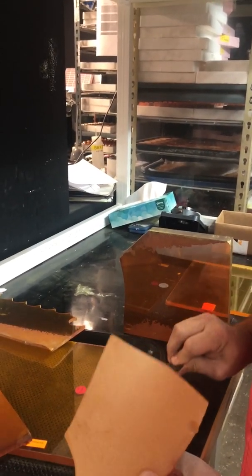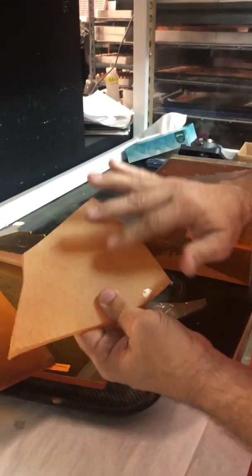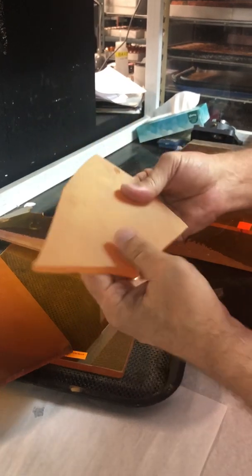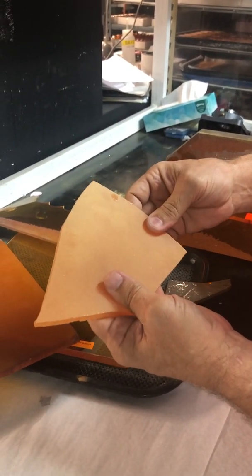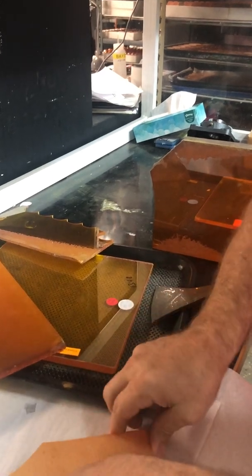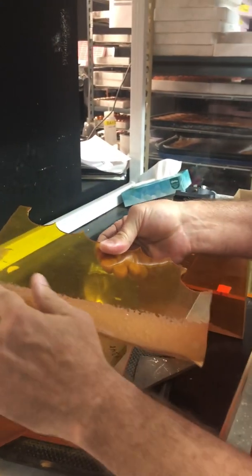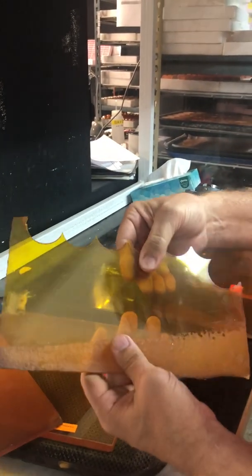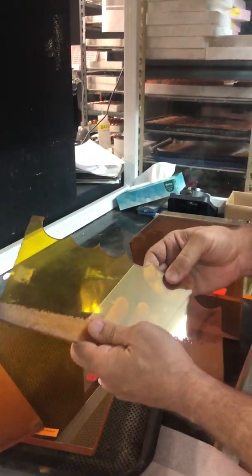After that, we'll get it like this — this is as-deposited. It has like an alligator skin to it, and we've ground away the black. From there, we're going to process it for inspection. This is a piece where you can still see how the alligator skin is there, and we've now ground and polished both sides.